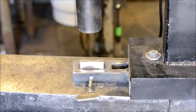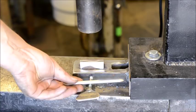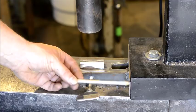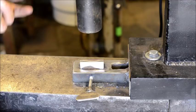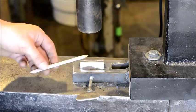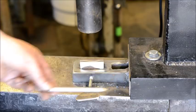Okie doke, real quick before I make 1/2 of these tong jaws on the tong die itself, or jig, I'll show you how quick this is. This is all part of the design. There's a spacer plate here that lifts everything, and on the revised design, these side pieces or cheeks will go down a little longer than in the original design. And there will be a much longer attachment bolt for that. Essentially everything else will be made the same for you guys that are already building these hammers. Just the new design will have the spacer plate included and the whole die holder and some variations for the actual hammer itself to make it perform.